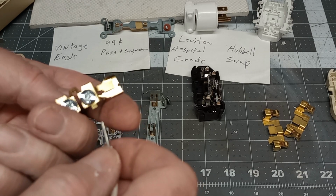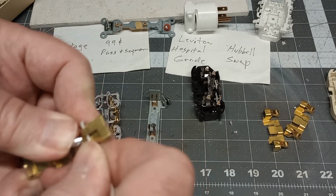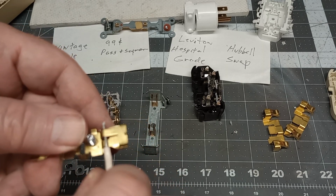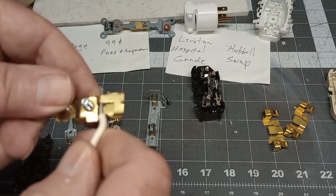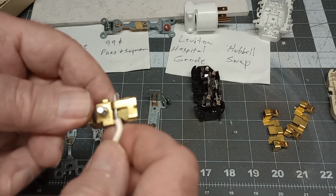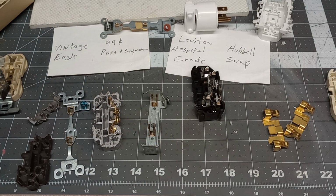Okay, it would be in from the back, so you can see how that wire is held in there. I mean, I can't see how that, you tell me, does that really make good contact inside there? I don't care for these, but they got them on the market, and I guess they passed some code, but I just don't care for them. I'd rather wire directly, or the clamp type. This isn't a clamp type.